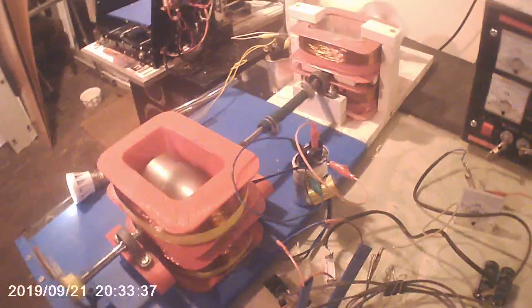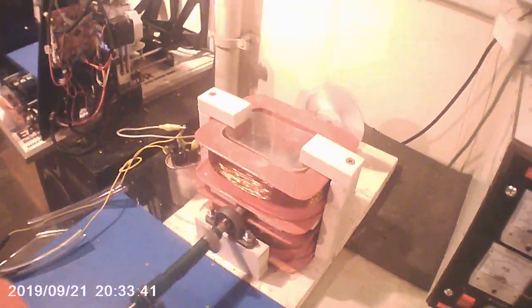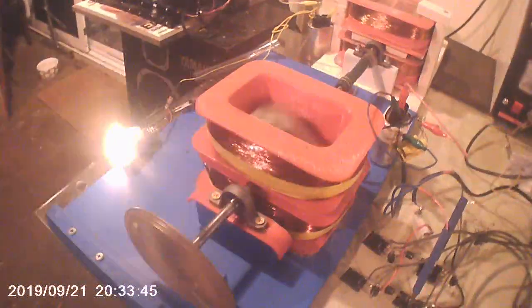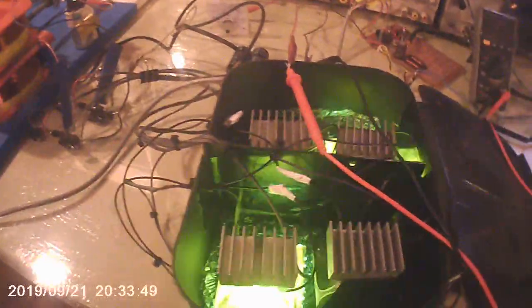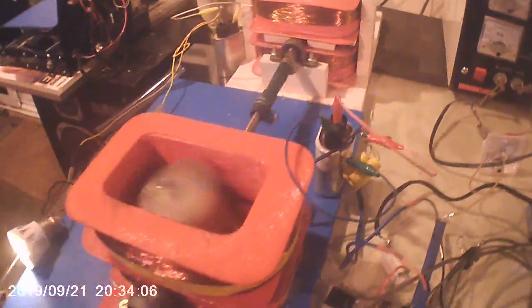This is really why I wanted to run the test. With my previous load test I was putting so much load on it — I was putting a really big powerful light globe on it, and that's not ideal. Because the ideal output for these motors is probably something in the range of about 5 watts or even a bit less, because they are very small. So I gave them a load that's more suitable to their size, and I wanted to do that before I went on and built the bigger machine.